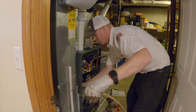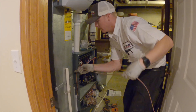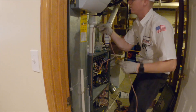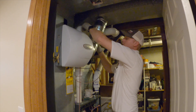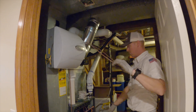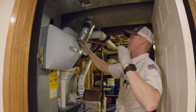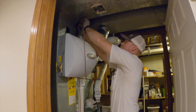This is the control wire that will turn on the humidifier and turn it off. It needs to run from the humidistat through the humidifier itself and then also tap into the main controls for the system — the heating and cooling system.